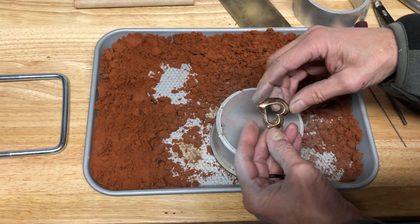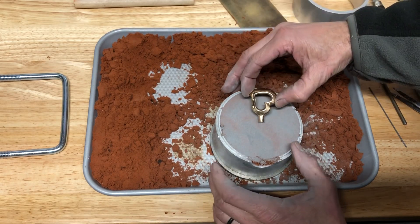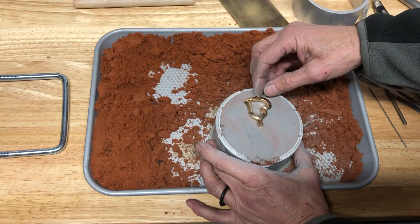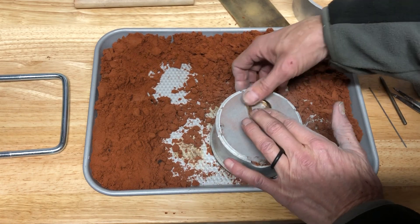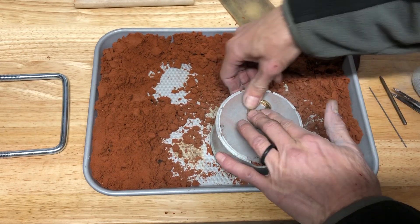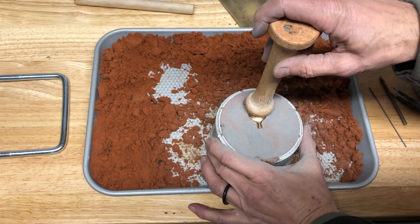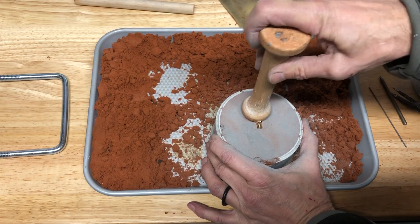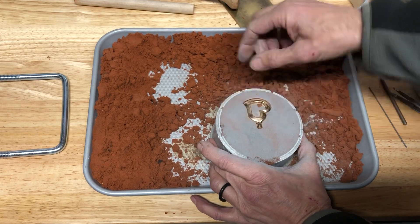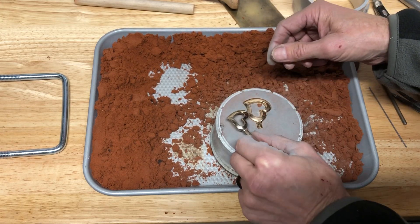I have my patterns, and with Valentine's Day coming up I figured hearts would be the thing to do. We're going to take the big one and put it in the middle, because you want that straight-down pour going directly to it. I found that if you take a tart tamper — which you can buy at the hardware store — you can really push these down. I like to get this side deeper than the other side because it has the vents.